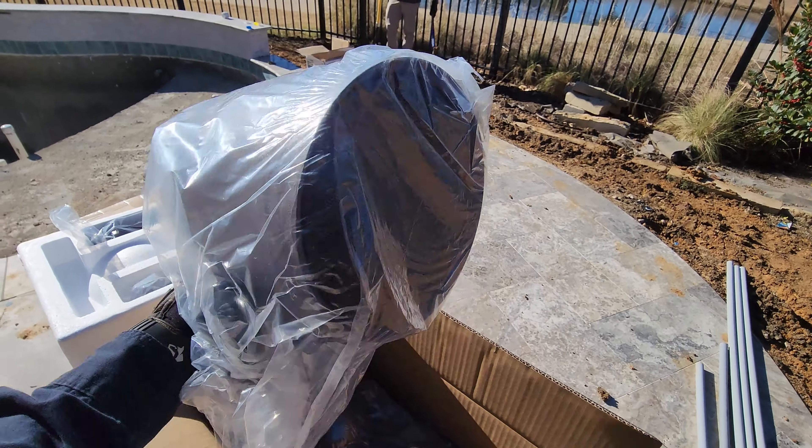We're going to do two speakers here so that this is a nice sitting area, and this run goes for the pool. This wall was added between our initial meeting, so we originally planned speakers along the back, but they'll just reflect sound now. Where we're digging we're going to put a sub and wire it in parallel — from the amp to the sub, then branch out from the sub to the speakers. We're also running an extra 14-gauge cable in case they want to add on additional speakers in the future.